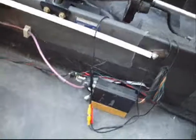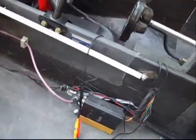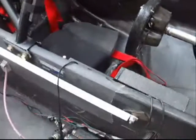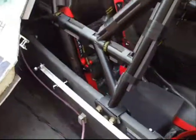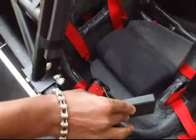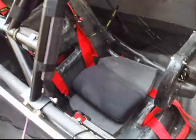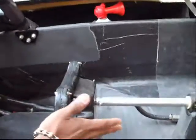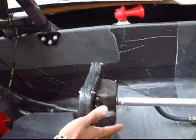What have you got here? That is our telemetry unit. You've got a chase vehicle — yeah, we drive in a convoy, lead and chase. Our chase vehicle gets live data streamed back from the car, and it also monitors our battery pack. We have a rear-view camera display coupled into that to help with backup. We have the Tritium display that gives us our bus volts, bus amps, and velocity. We also have left and right turn signals, and our velocity and accelerometers are right here.